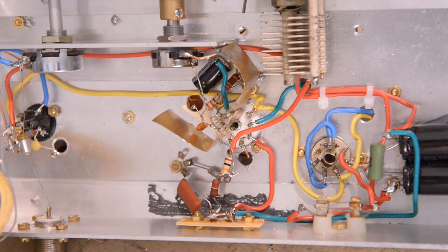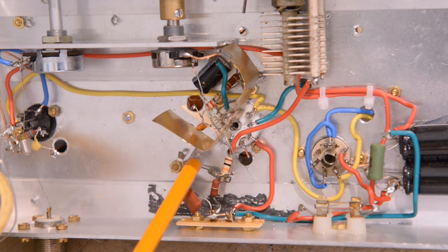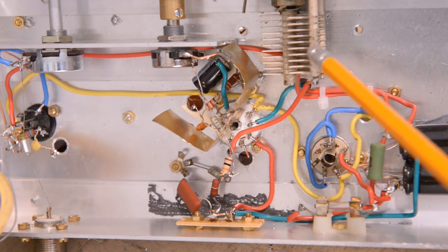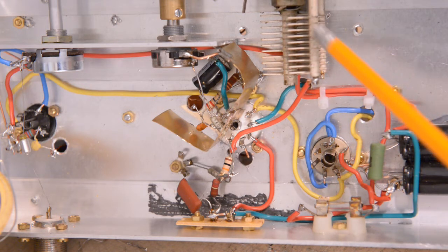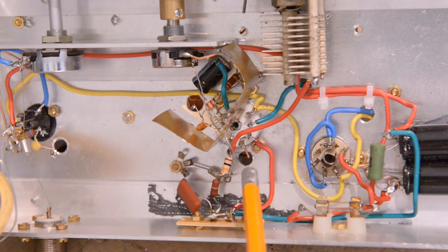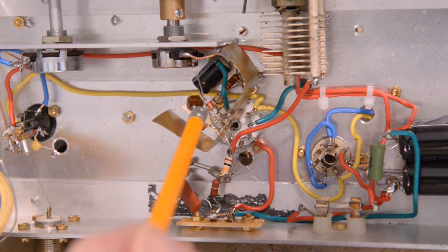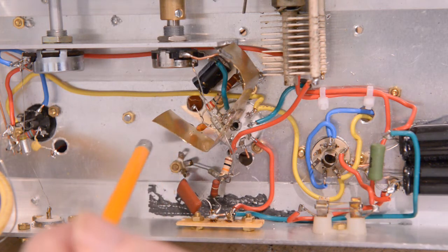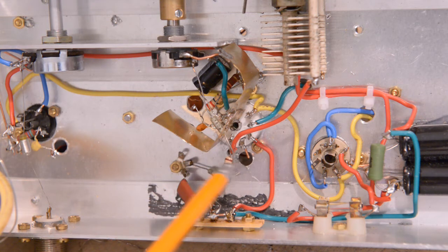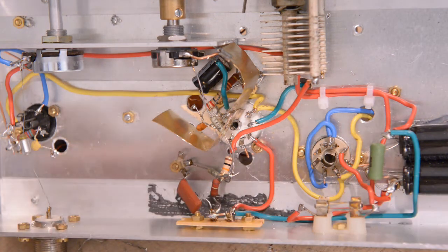Hi guys. Well, I've done everything I had to do. So I got that wire that was there. I came around here underneath that resistor. That picked up all the signal from this wire, from the tuning capacitor from the tickler, and it also picked up from number 1 on that side. The possibility is you pick up from number 1 as well. And then it came around here and picked up from our anode 9 and went to cathode number 8. So I avoided that and I put it on the other side, so I can show you.